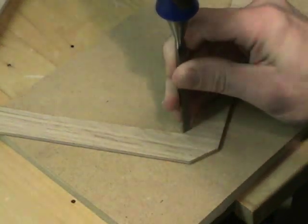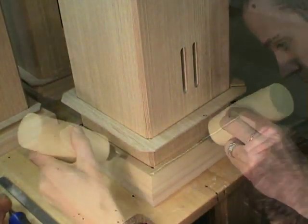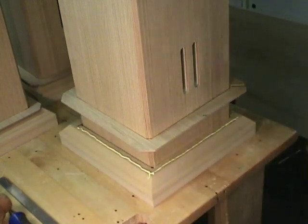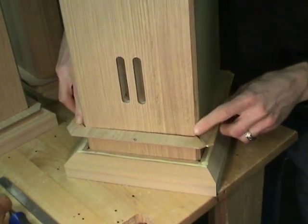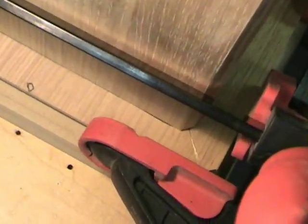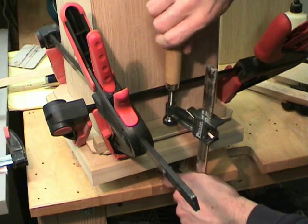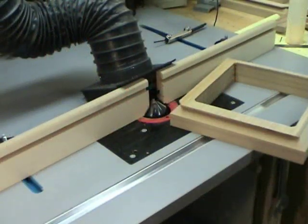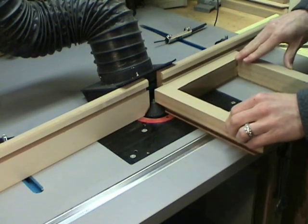I square up the inside corners with a chisel and use a file to smooth out the edge. To glue the panel material to the top side of the foot, I apply yellow glue and also put some glue in the seam of the panel material. Clamping is a little tricky — I have two things to concentrate on: bringing that seam together and providing downward pressure to hold the panel material to the foot. After that's dry, I can use the same chamfer bit with the bearing removed to flush the panel material against the foot. Now we have a nice smooth chamfer ready for veneer.